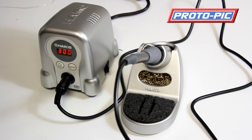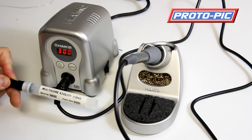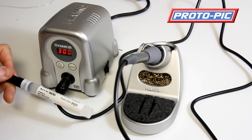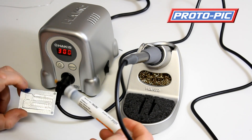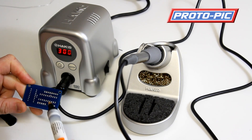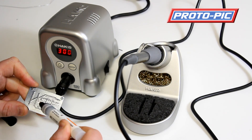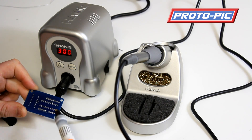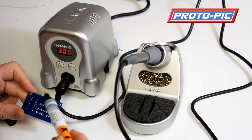We're going to change the camera lens into macro mode so you can see some close-up soldering work. But first I wanted to show you this — it's the multi-core flux we're going to be using. It's a water-soluble flux and it comes in a pen like a felt tip. When you're about to solder something, on the side that's going to be accepting the solder, you just draw this like a felt tip marker over the top of the pads. It introduces the flux and the flux cleans up the solder joint, preparing the surface so that solder flows readily across it.